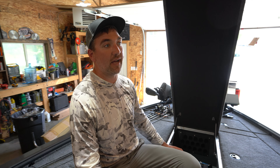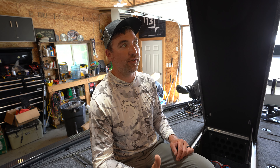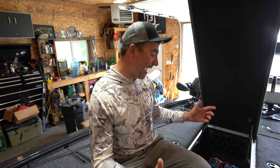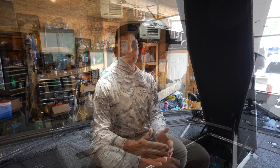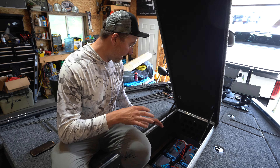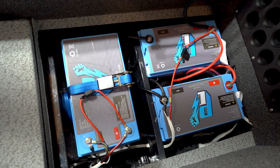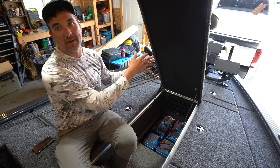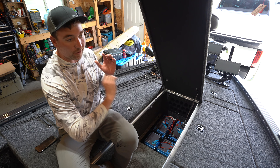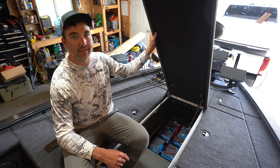Another thing you might not think about: this is 105-amp-hours at 16 volts, so it's actually 25% more than a 12-volt battery. The math works out to around the equivalent of 130 to 135 12-volt amp-hours. It's tons of power. I've got five big graphs on this boat that are all power pigs, and I'm not going to have any problems, especially with the run-and-gun charging system. Also, with the boat preset for a 36-volt three-battery system, switching to two 36-volt batteries freed up extra space. I took a whole battery out of the boat, so now I can have this big power pig up here with direct runs to my front graphs using the factory power harness right into it.